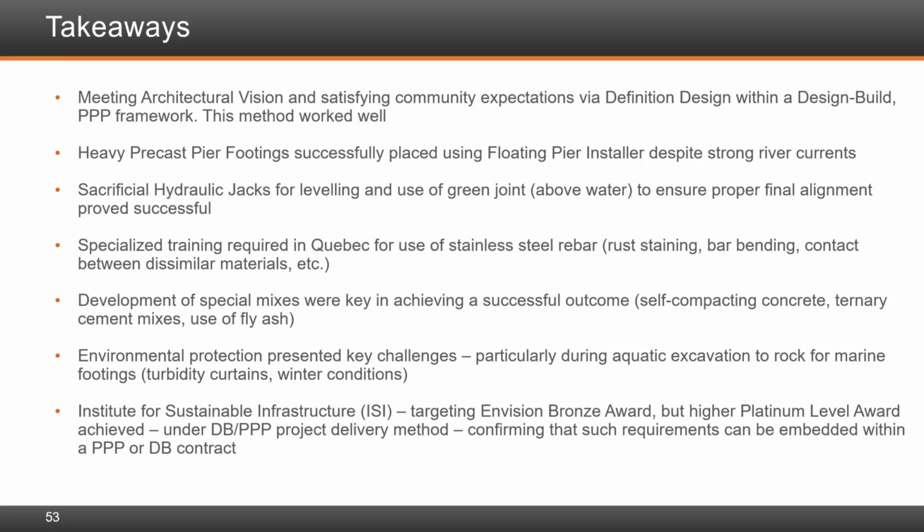Obviously, the governing loads for earthquake and wind need to also be taken into consideration because the probability of occurrences changes. You'd have to account for that as well. But all in all, our experience is that when you're doing a major mega investment on a project such as this, designs are in the order of 125, and it's becoming almost industry standard.